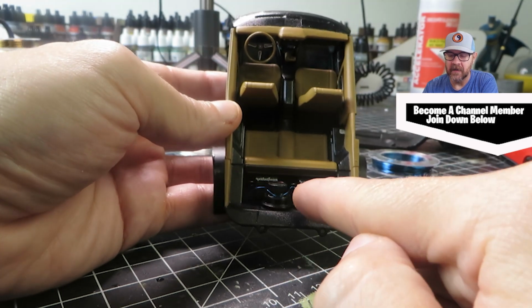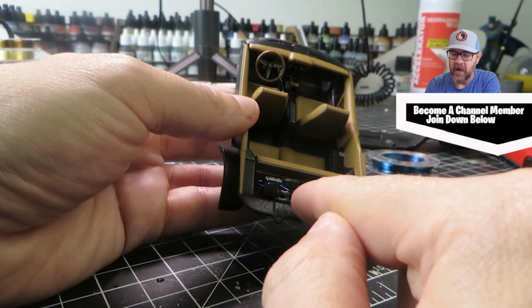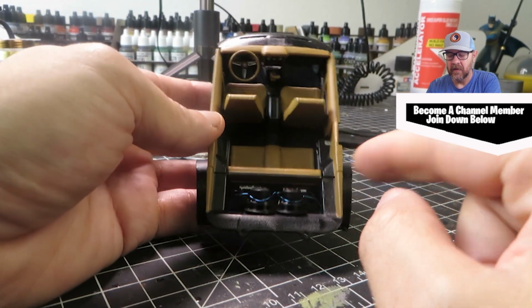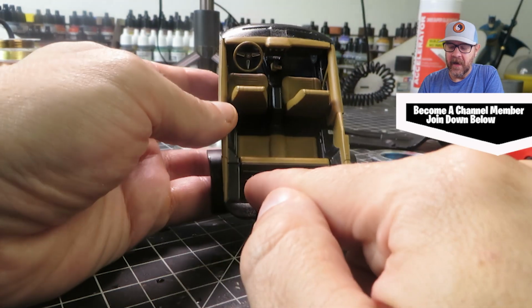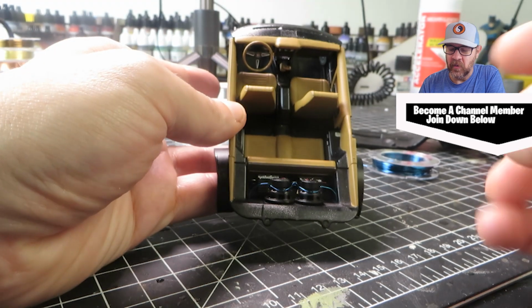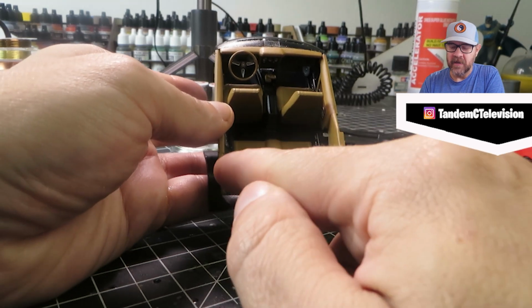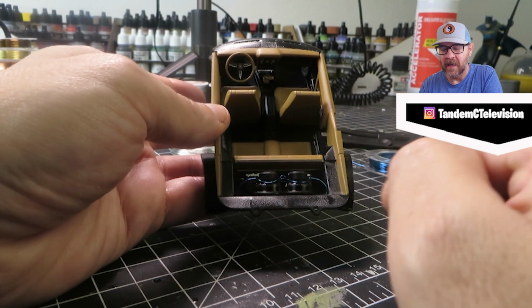That's what I used to wire up the speakers here. These little speakers were dual voice coil. There were 2 sets of terminals on them that were printed into them, which I painted gold. I don't know if you can even see it, but I painted the terminals gold. And then I wired it. I just assumed they were dual 4-ohm voice coil speakers, so I wired them up parallel here. We'll say this is positive coming in, then we have negative to positive and positive to negative, and then negative coming out.